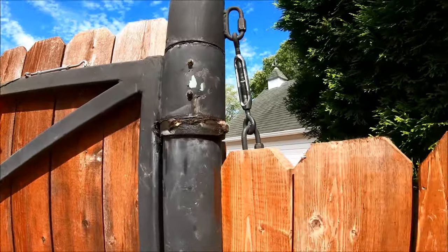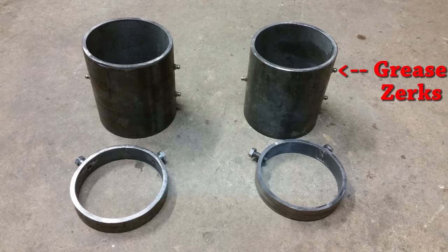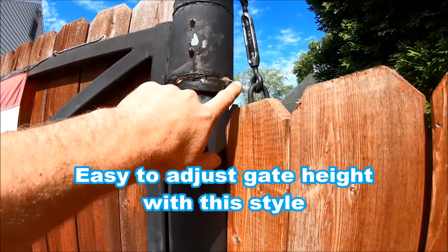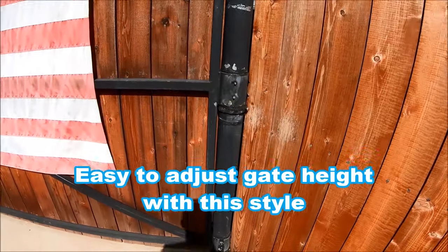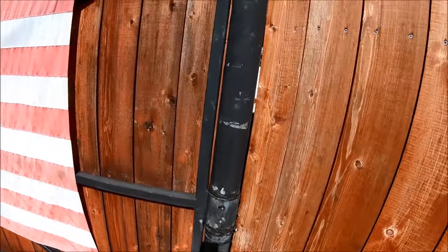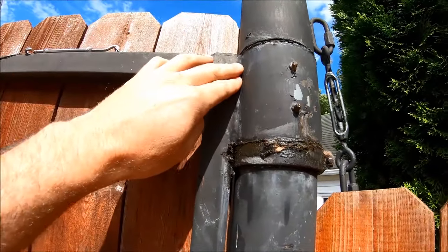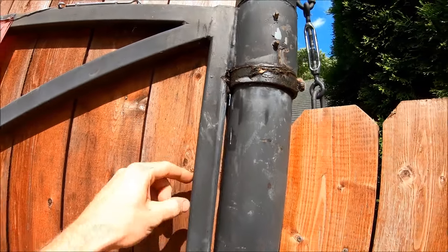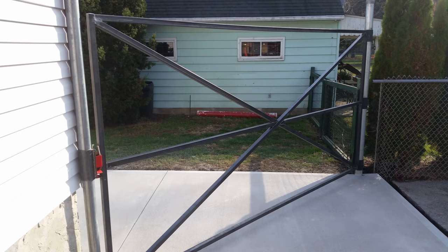It's got three hinges that I cut out of four-and-a-half inch pipe. The ID is four inches with quarter-inch wall, so it slips right over the post. I cut these collars too — three of them as you go down — and welded the verticals directly to them so that nobody can just unbolt your hinge.